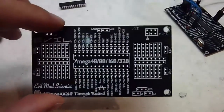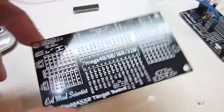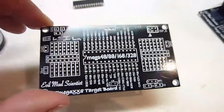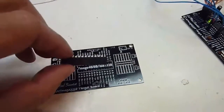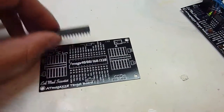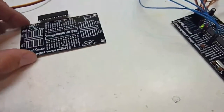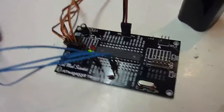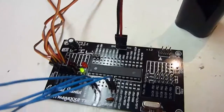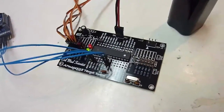So instead I took a look at that board available from Evil Mad Scientist. It's less than 3 bucks actually, and all you do is you buy your 5-dollar Atmega controller, solder it in there, and there are conveniently a few pins to put headers on and configure it any way you want. So for less than 10 bucks, here's my 10-servo controller, and it also has an RC input.